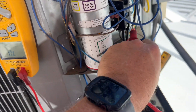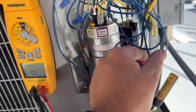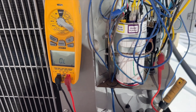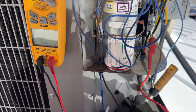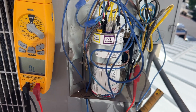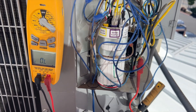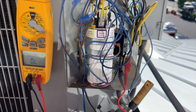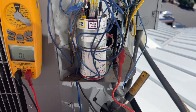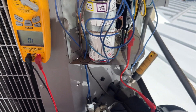Running the fan will also let me see if the outdoor fan motor actually runs. We're going to leave the compressor disconnected and just run the fan — hopefully that will bring our pressures down and reset the trip. I'll have to manually push the contactor in, and hopefully it'll get the pressure down enough for the high pressure switch to reset and help cool the compressor — not as good as water, but better than nothing in direct sunlight.